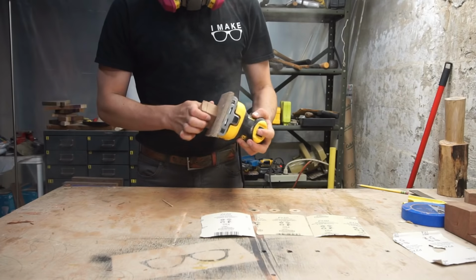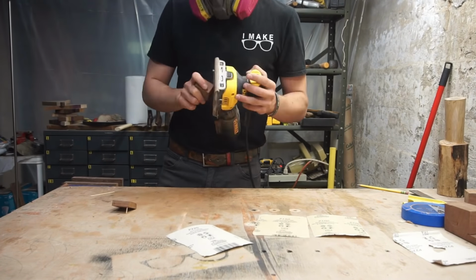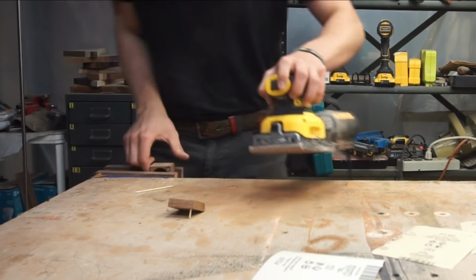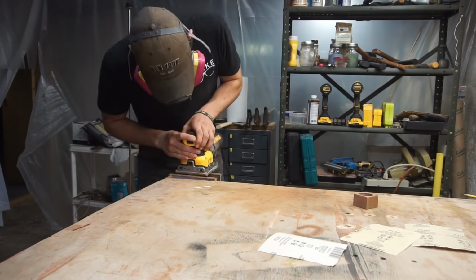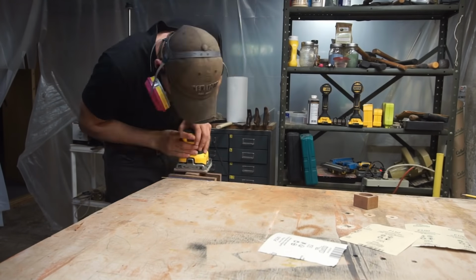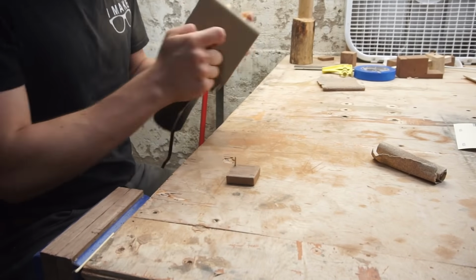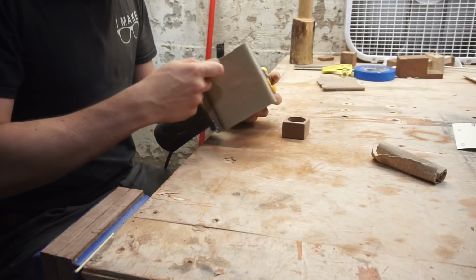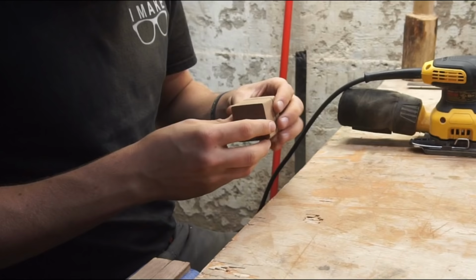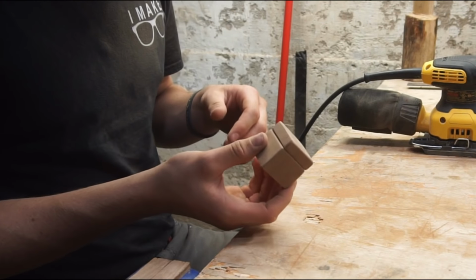When it comes to sanding, you don't need to go over 220 for this type of project. I used 100 grit, 150 grit, and then all the way up to 220 grit, doing the bulk of the sanding with my finish sander. The lid is very fun to play with. It snaps closed with a very satisfying click.